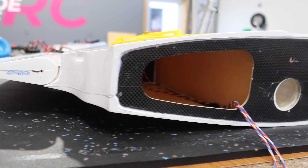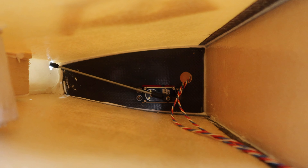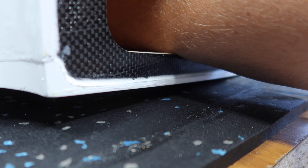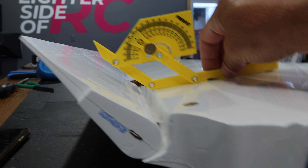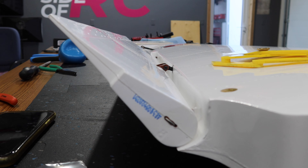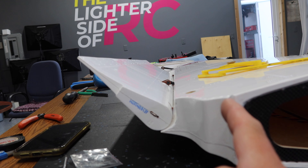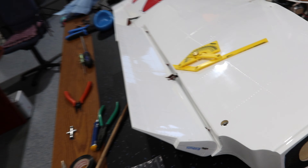Here's how this is working - we've got the flap centered. I'll move the flap to the 100% mark and the rest will have to be done by hand. The nice thing about this wing is the root has enough space to reach your arm right in. We don't really need power on the servo at this point because mechanically that's what we're looking for to get our 45 degrees. We've got the arm put through with a bolt and our angle finder set to 45 degrees - and we're a little bit shy, so we need to shorten this linkage. Both ball joints are turned all the way on, so we need to take it off and cut the rod to get a shorter linkage length.